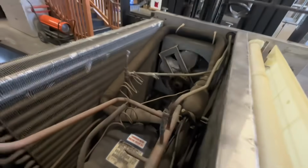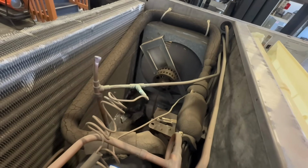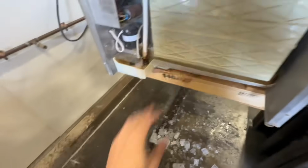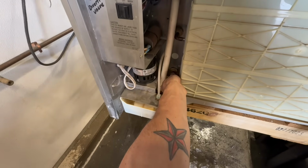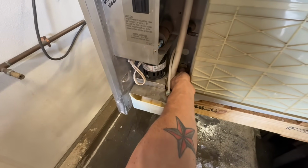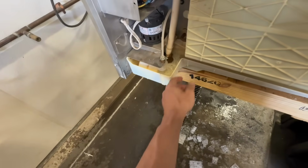There it is, good shot. Sheet of ice. Harvest assist should roll to the back position. And when it gets there, it'll go from being in harvest to freeze. There you go, click. Put this back on here so we don't overheat and shut off. Oh, that's still warm. Oh, maybe my hot gas valve stuck open. Oh, yep, now we're getting cold. Took a little bit of time, but that's cold now. Yeah, I think we look good.